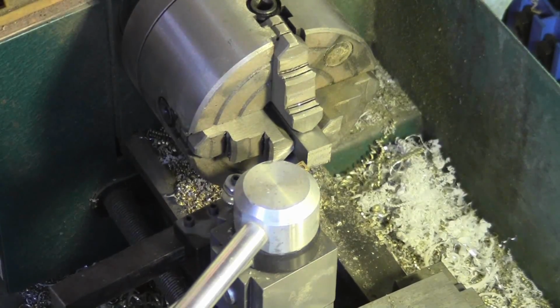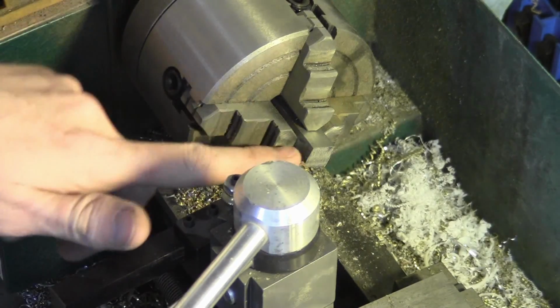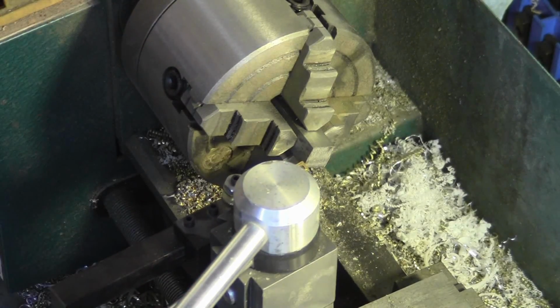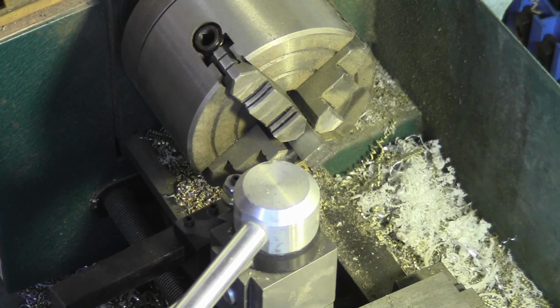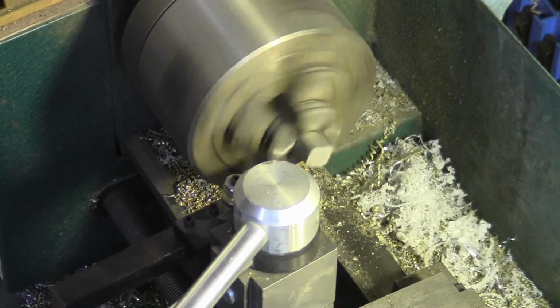Alright, excuse me, so I've got my tool bit in. I don't think it's a CPNG, can't remember now, but it's a tiny little carbide insert, nothing fancy. We're trying it for the first time. I've never used it before. It's a totally new tool holder even, so we're experimenting. We'll see what happens. But I'm just going to face off the end of this square stock, and then we'll get ready to peck the drill in, and then we'll do some tapping too.